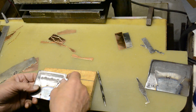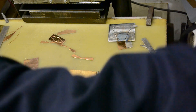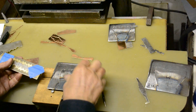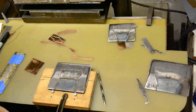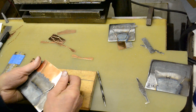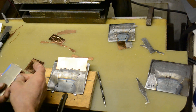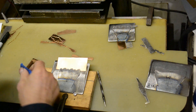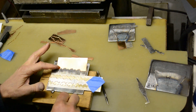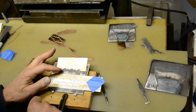These are set up so that you can repeat the pattern along a strip of metal. Here's the die — let me put a piece in there so you can see it's designed better. This is one of my standard zigzag designs, and that die was made to cut all of these pieces just by making one cut and then moving the metal over and making another cut. It's tricky to line them up right, but they are set up so you can do that — the pattern repeats itself regularly.